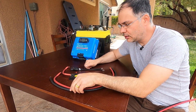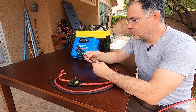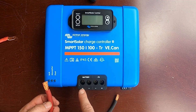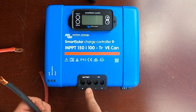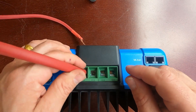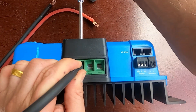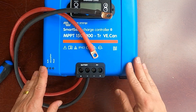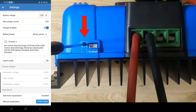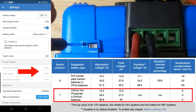Before we start our 12 volt test, we're going to have to install battery cables, a circuit breaker, and some PV pigtails for our 2000 watts of PV power. The red wire goes in battery plus and the black wire goes in battery minus. I really like these terminals because they work great with stranded copper wire. Screw down the terminal. Now our battery cables are installed. Be sure to set your battery type using the rotary switch before charging your battery. Position number seven is for lithium iron phosphate battery chemistry. Each position will set the default absorb and float settings for your battery type.